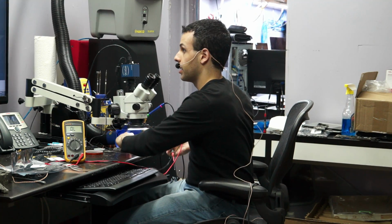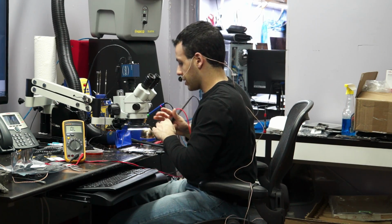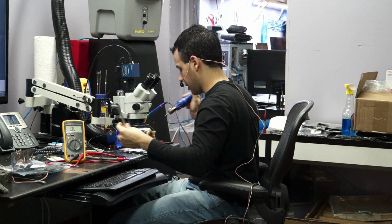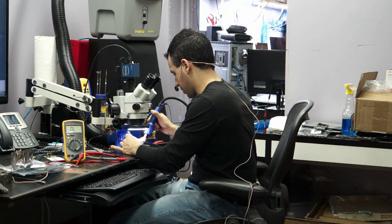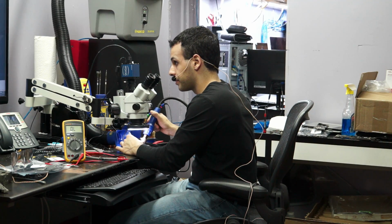Still shorted. So now I remove the larger output capacitors, and if that doesn't fix it, then I will start running power. Of course, it's not going to be what it is 99% of the time because I'm doing a video. Shit never ceases to amaze me.